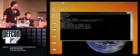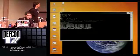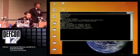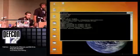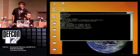All right, first thing I need to do is tell the program what the distance is between our Wiimotes. Currently, we have them at 36 inches apart. It's whatever the user decides, but we found that 36 creates a decent viewable range from both Wiimotes.